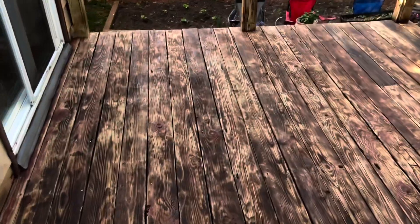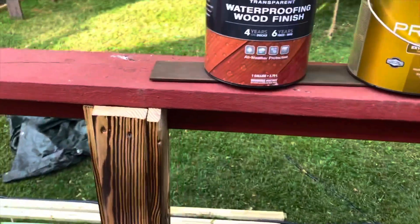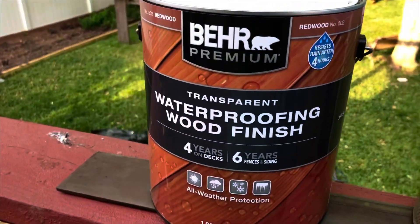Alright guys, deck is prepped. That is as far as I'm going - burnt it, brushed it, sanded it. I left it at 80 grit which is plenty, and it's actually pretty cool. I don't want it to be perfect because this wood isn't perfect. These are the two patched-up areas here. The railings are reinforced - that's going to be black later once I finish building them.